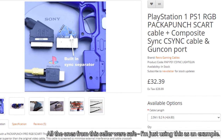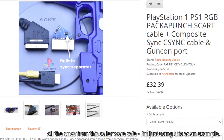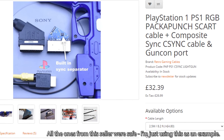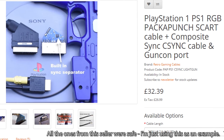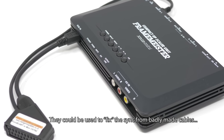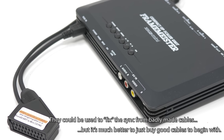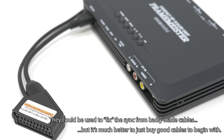So why do we still hear so much about sync strippers? Some cable manufacturers would refer to cables with sync strippers in them as C-Sync cables, so lots of people bought them without realizing there was a stripper inside. Technically they did output C-Sync if built correctly, but if built wrong, they'd output TTL and become a potential hazard. Also, many years ago some people tried using them to fix certain issues that were better cured in other ways. People in the scene, as well as cable manufacturers, eventually learned what components were really required and stopped using them as band-aids.